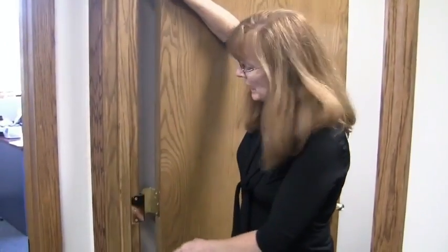You see here, the door itself takes up some room in the door jamb. If we use a product called an offset hinge and just replace the hinges on the door, we can use the same door, the same door jamb, and the same door handle.